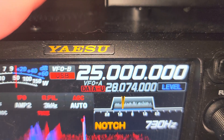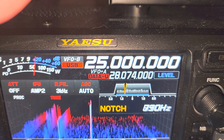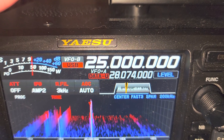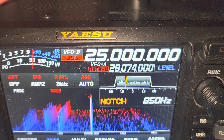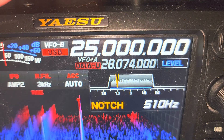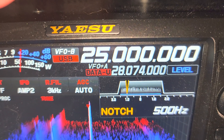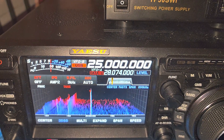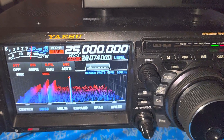We're going to go down in frequency until we are on top of it - and notice, I removed it. Moving off, I'm going to wait till the next tone and do it again, since it will be at a different frequency. Here's a tone - we go and get the V-shape on the tone. Notice that removes only pretty much the frequency of that tone; we hear the WWV time pips but don't hear the tone anymore.